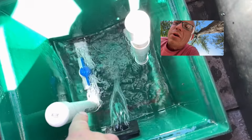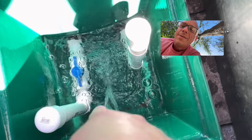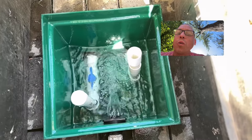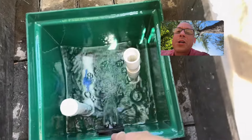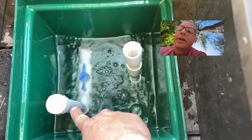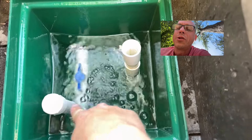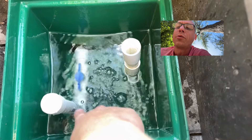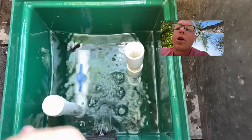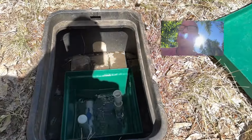The water being forced through these little holes is what gives the silt time to settle in the bottom of this spring box. Fresh mountain spring water flows into the spring box and is forced through these tiny holes in what we call the filter tube — but this tube does not filter for drinking water safety. Like I said, the water is tested, potable, and safe to drink straight out of the mountain. These tiny holes simply strain the water so that the silt has time to settle in the bottom of the spring box.